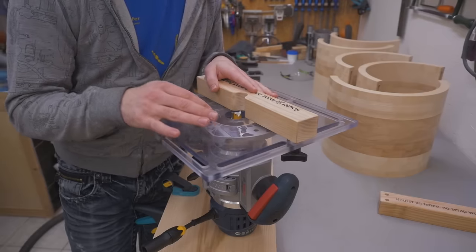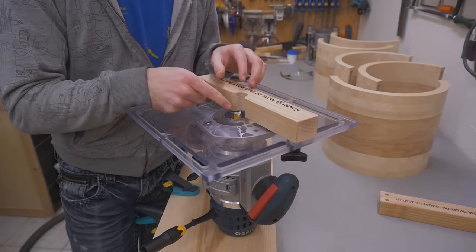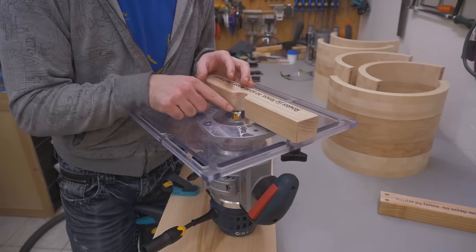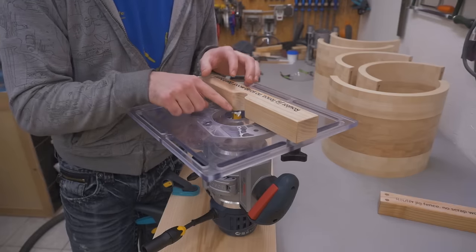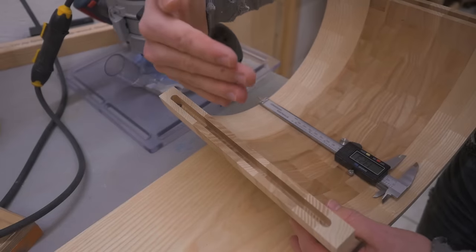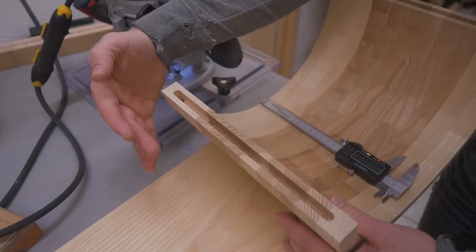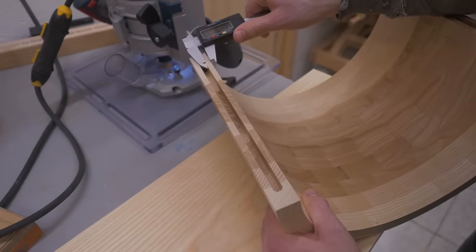That will be a lot more setup work, but then I won't have alignment issues afterwards. I'm using this pretty simple router jig, which I also have a video about on my channel, and I've set this fence so the tongues are 1mm less deep than the grooves, so there's room for glue, and the height of the bit, which will determine the thickness of the tongue, I will set every time individually. I'll try to align the boards with the inner part of the curve, because on the outside it's much easier to correct any mistakes by sanding. And now I try to find the thinnest part. 6.1.